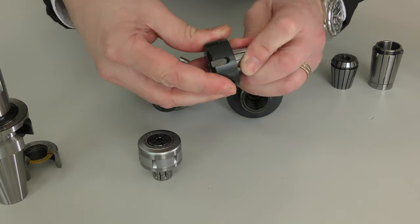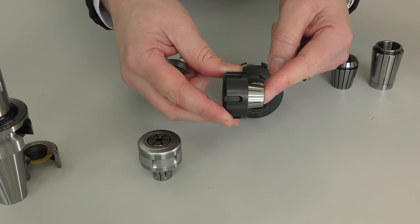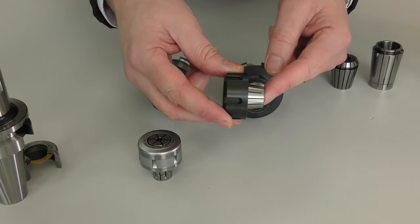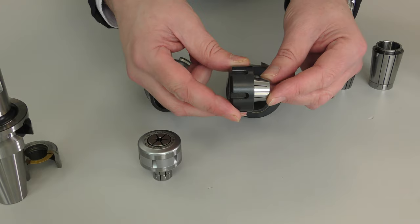Because it's 16 degrees with a double angle, it neither lends itself realistically to accuracy or rigidity. You also have to put a lot more clamping force in during tightening to achieve a reliable grip on the cutter that you're using.